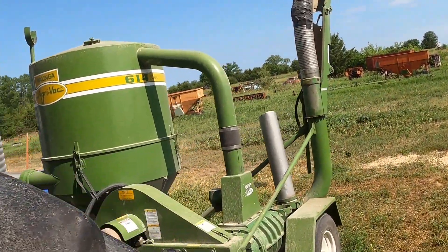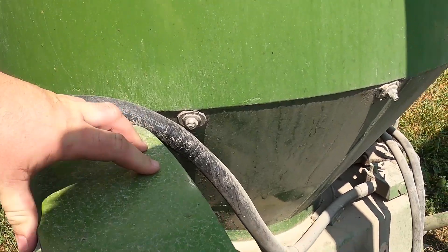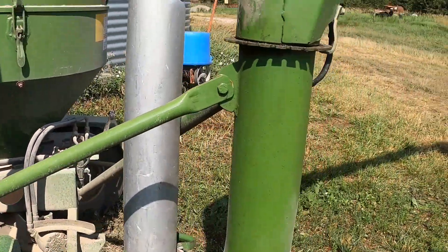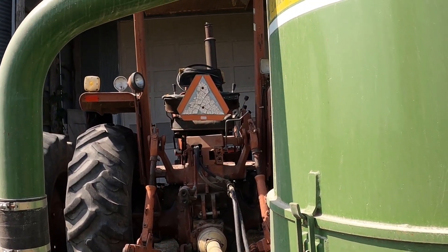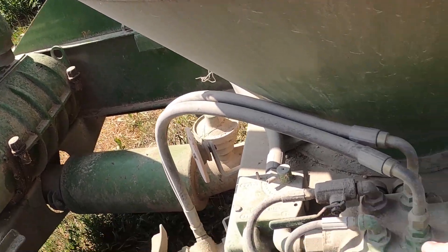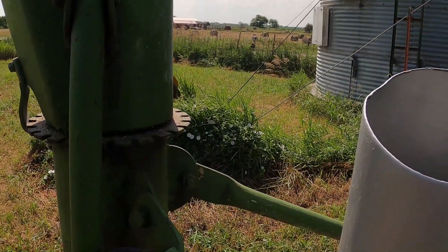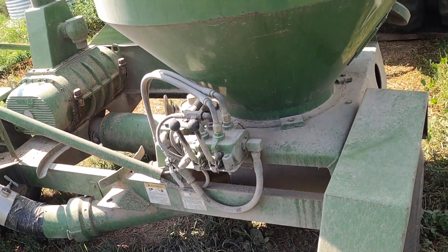Basically this is just a big vacuum and it sucks the grain out for us. There's a big gearbox and four belts under here that run the blower motor — this is the blower motor right here — and there's a shaft on the front of that that spins it, and it sucks the grain into the tank and then spits it out the spout. It does run on hydraulics, so you have to have hydraulics running continuously. There's a valve here — you can't use both functions back here at the same time. This one raises and lowers the boom so you don't have to do that manually. You do have to swing it around manually. And here is how you turn the airlock on, which is what starts the blowing out.